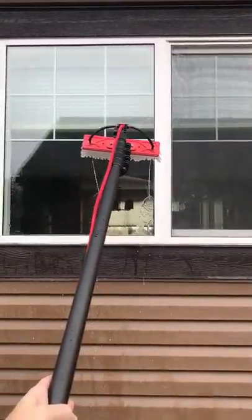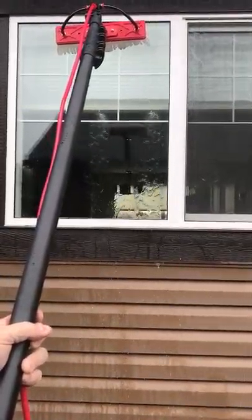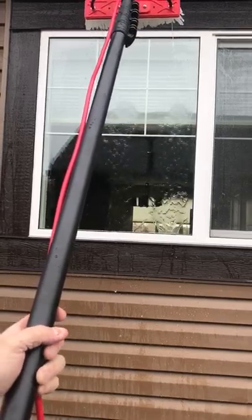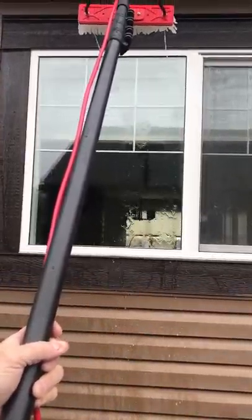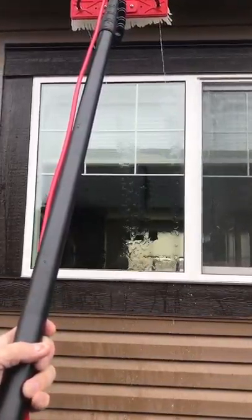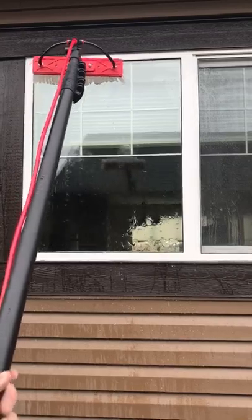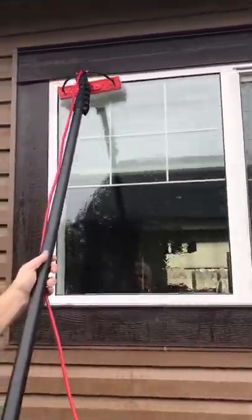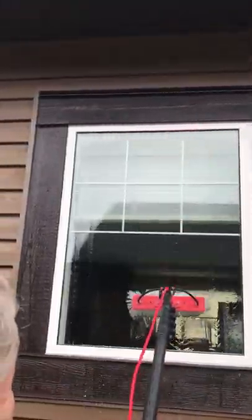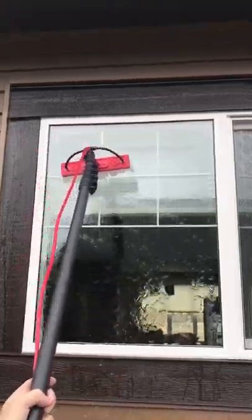This is nice hydrophilic glass. That means the water sheets off of it, which is exactly what you'd like. Some commercial windows may have hydrophobic glass, which means it kind of looks like little bubbles of water when you put the water on them, kind of like wax on a car. In that process, you just have to clean it a little bit longer — it takes a little bit more delicately. When you rinse, you have to rinse maybe two inches down and across, two inches down and across, two inches down. But this way, because it's nice sheeting action — see how that sheets off there nicely?